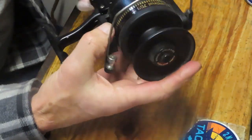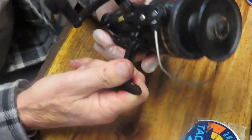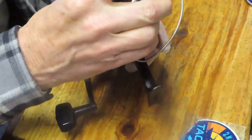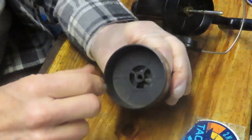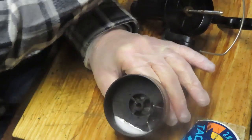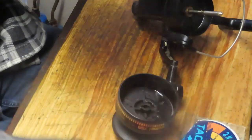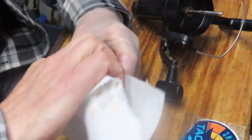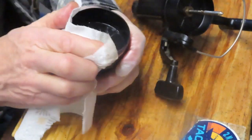Other than a lot of surface dirt, I did notice some sand, but all the tests work well. We're going to start by taking off the parts. The spool is just a simple push-down button spool and you can see we have some dirt and debris in there. I'm going to start with a squirt of penetrating oil to loosen that and then wipe it off with a paper towel.